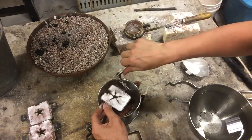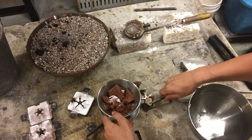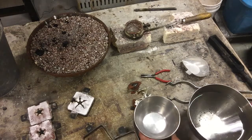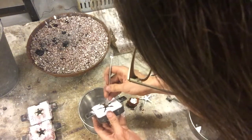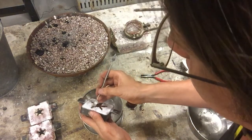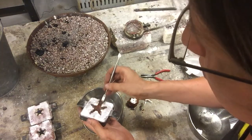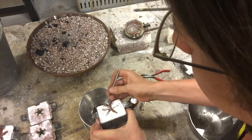This one we can grab from the top side — released really well, so we can scrape it. I always use the red color as an indicator of the sand's integrity. We're going to take these parts, dump them in the good sand bucket, and then collect the remainder of bad sand from the molds. That's simply done by scraping out the charcoal parts, because those are burnt to the point where they don't have enough binder. Once it's turned gray, it's really hard to tell if you have enough binder. So I always remove that — once it's all red again, we're good.